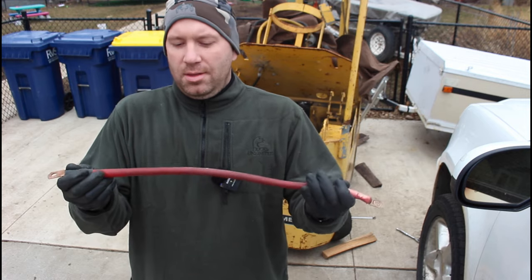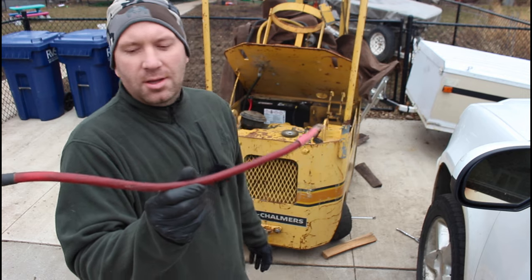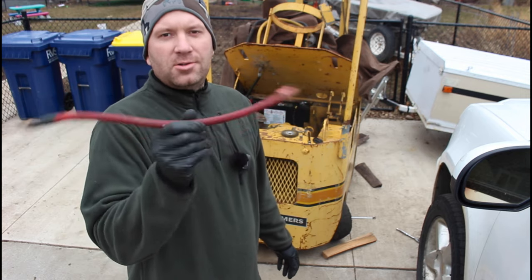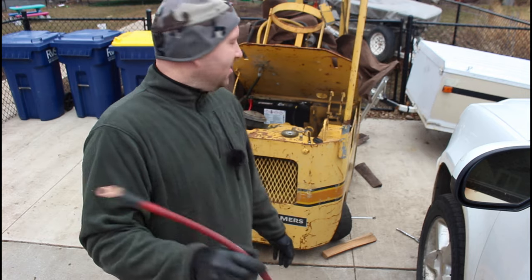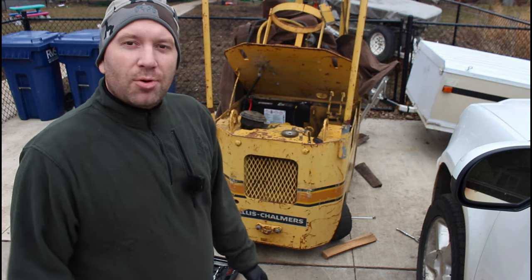Anyways, this cable, I think, was our culprit, because after I swapped this out for like an 8-gauge or a 6-gauge, it actually worked. So we got the thing cranking. I don't have any starter fluid. I might go grab some here, but the other thing is I did buy a propane tank for this thing